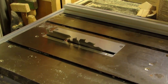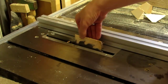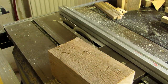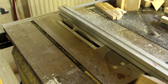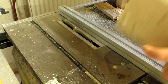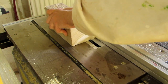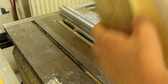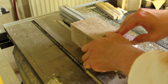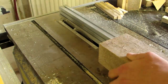Next, you need to cut away the corners, which will later serve as supports or columns for the roof. The easy part is to set the fence to the desired width of the supports — feel free to experiment with different sizes. The harder part is to set the blade to the right height, which is a little higher than the width to make for a crisp corner. The best way to do that is to work your way up to it. Set the blade to less than the distance of the fence and make a cut in one corner, then turn the piece so that you are going to cut the other face of that corner. If the roof went in first on the first cut, the bottom needs to hit the saw first on the second. Now you can easily see whether the blade needs to be raised.